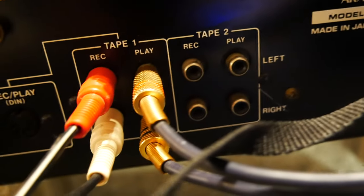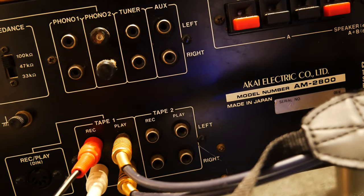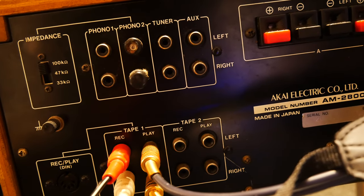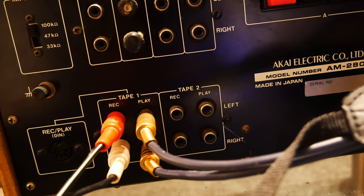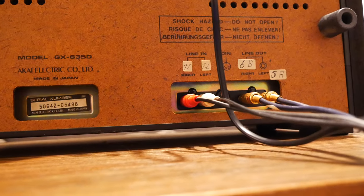This is how I always connect the stuff. If you have a modern amplifier, you can connect the same reel-to-reel deck to it — that's not a problem. You only have to use high input levels. On modern amplifiers you have, for example, pre-out. Never connect the reel-to-reel to pre-out, a low level output, or a subwoofer connection — those are low level inputs. What you see over here are high level inputs. So you can simply connect the reel-to-reel deck to a modern amplifier, to the video channels for example — all those video channels are high level inputs and outputs.